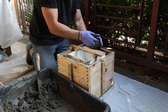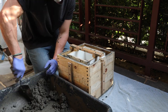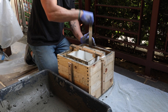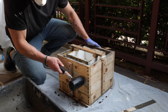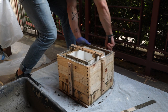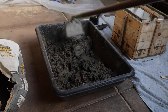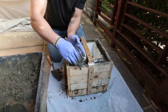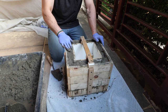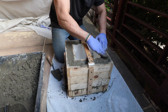Just as a side note, you can probably see that there are a lot of extra screws in the side walls. That's because this is the second time I used this mold, so I'm using some of the footage from that. It is very important to tap and vibrate every side of the mold — this will remove a lot of the air bubbles and will help fill all the voids.